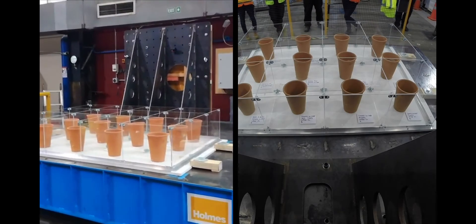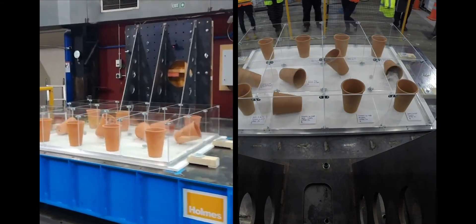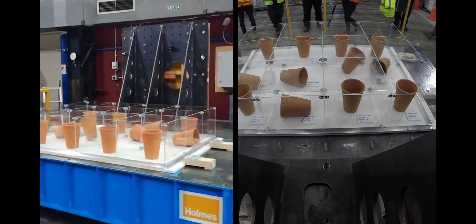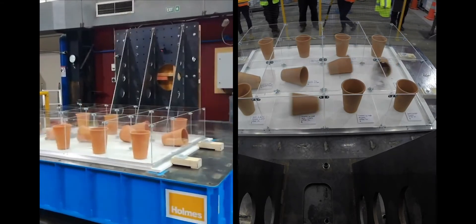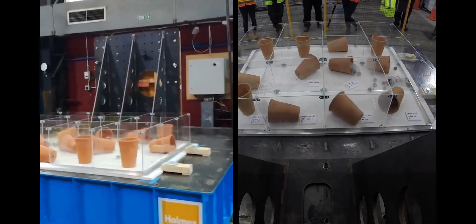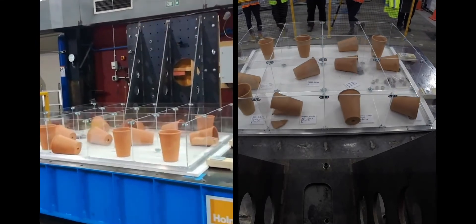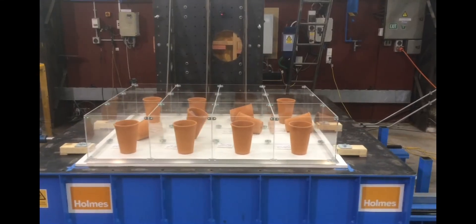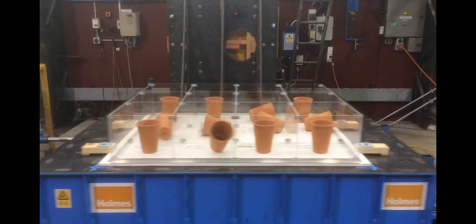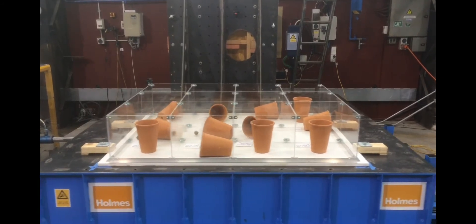Although tilt tables are an easily accessible test method, our results with creating a more real-life earthquake has given us greater insight into how the adhesive dots respond against other methods and materials, shown here shaken to 110% of New Zealand's building code. We are looking forward to extending this research with the University of Canterbury to provide more detailed recommendations of what is required for different sizes and weights. We are also exploring how the dots respond with age, as our results so far show that they are harder to remove after six months on display.